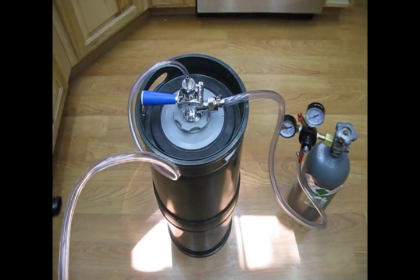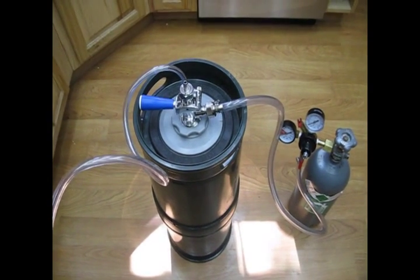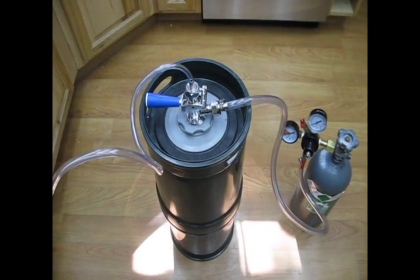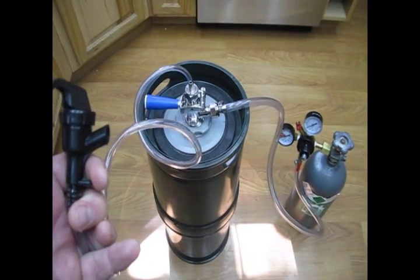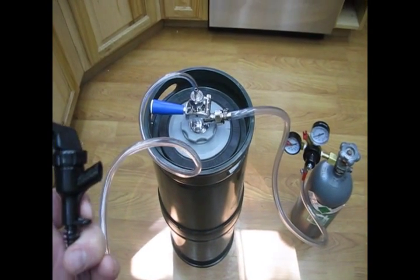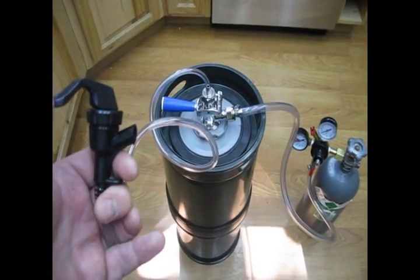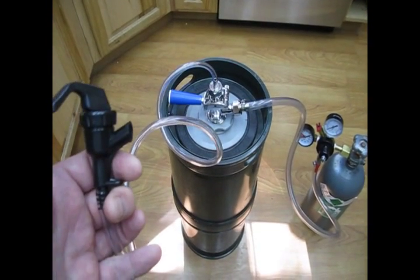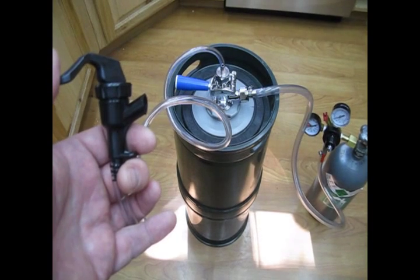To start off the purge, you'd begin with your serving valve in the closed position. The purge would be set at 15 psi. You will hear the gas going into the keg and you can actually hear the liner opening up. From time to time, just open up the serving valve to see if there's any back pressure being established. Once you begin to get some pressure — you'll hear the hissing out of the valve — then the liner is getting to the point where it's being deployed. It doesn't take much pressure to actually open up the liner, about 1 to 2 psi.